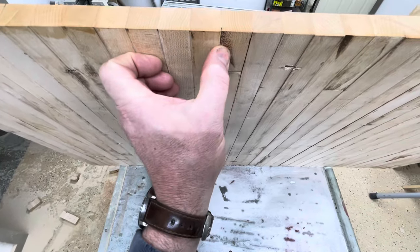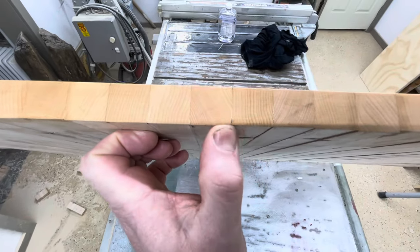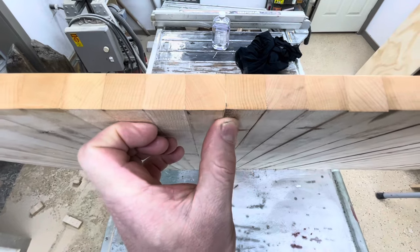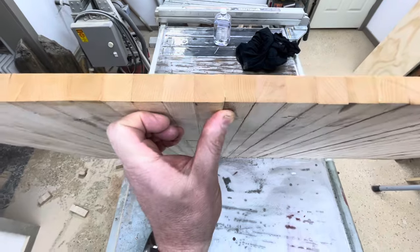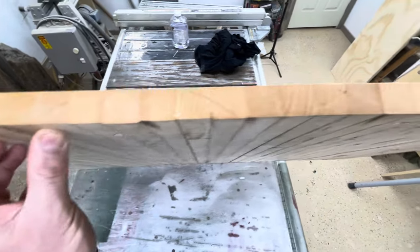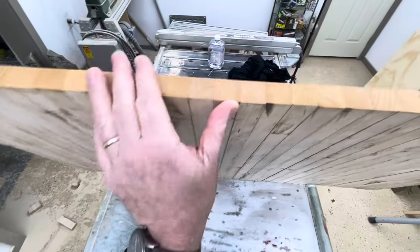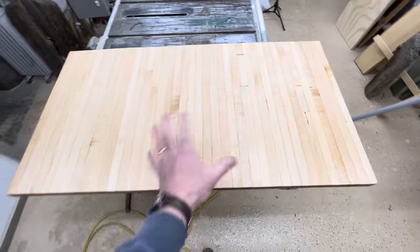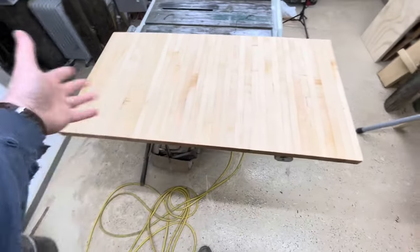What that's going to accomplish is the silicone will support the boards that are not touching the frame. It'll squeeze out all but that little bit. And then when the silicone cures, it'll work kind of like glue. It's not as good as glue, but you can remove it if you need to. If I have troubles with this, because it's kind of tough service, because these things go down the road, and the thing moves all over, this may crack, come apart.